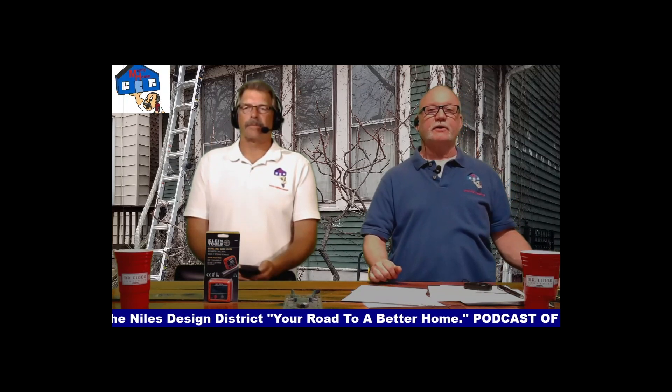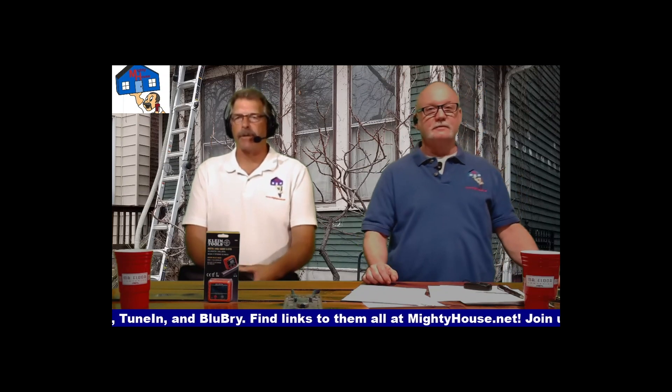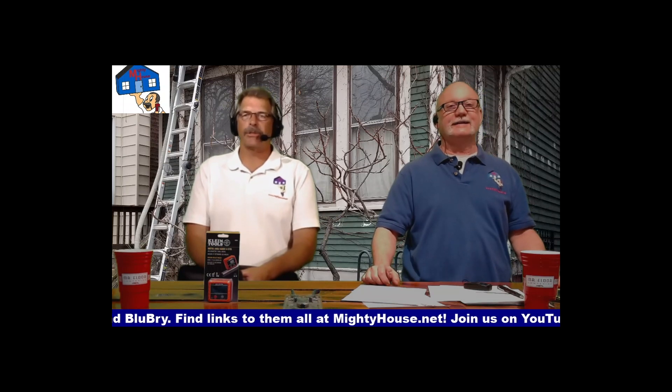If you were going to try to get an entire air change per hour out of your windows, you'd have to spend $18,343 per air change. One thing I want to follow up on is his actual energy cost savings — he'll need to go back through his old bills, note what he was paying and what thermostat setting he maintained, then compare that to now after all the improvements. I've done this where we doubled the size of houses and reduced their costs, because we did the air sealing and fixed all the mistakes without just changing the windows.